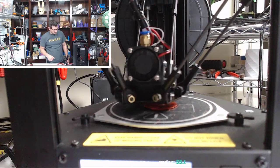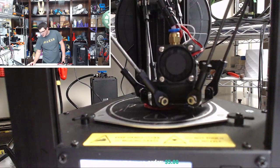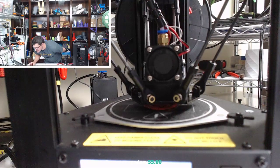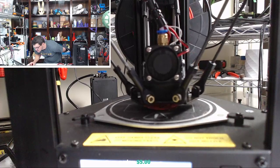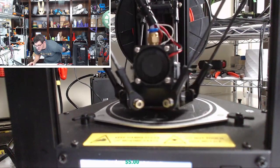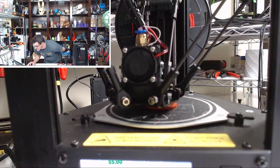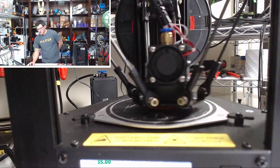I've already got all the three islands conjoining together, though, so that's interesting. Now, I can definitely tell that it needs to rotate, because if X is right in front of me, it's printing at 90 degrees. So I wonder if I can change that in the slicer. Rotated 270 would be straight then. Still have to remember that for this then.